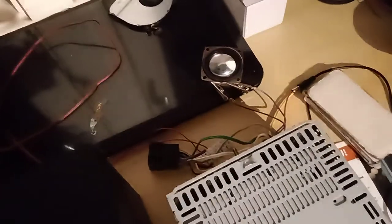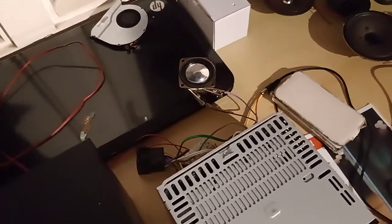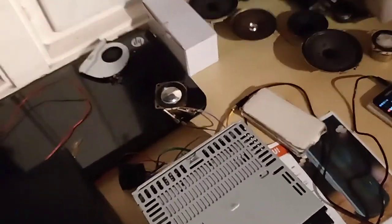Like, I'm not kidding. The one that I currently have connected has a slight dimple in the voice coil, since it has gotten so hot that it was starting to melt the plastic, sort of. You can barely see that, and it still sounds pretty good. Although the bass sounds a little weird. They have the ceramic magnet on the back, the older type. The newer type is this.